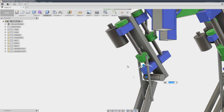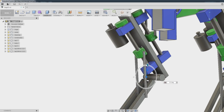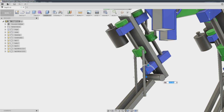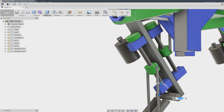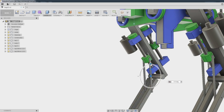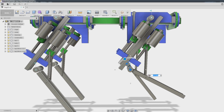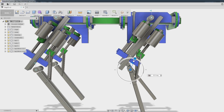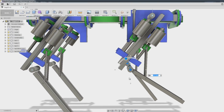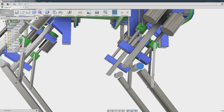And that's pretty easy to do because obviously we've got the motor turning, so we can put an encoder on the motor, we can put a home switch at one end of the ball screw to home it, and then we can work out at quite high resolution using an encoder how many times the motor's turned, or where it is in one revolution even, and that should give us quite accurate positioning over the length of the ball screw. Then using trigonometry, of course, we can work out the angle because it's a triangle, and we know what the sides are, and therefore we can work out what the angle is at the joint. That's why I've offset the joint here, because it makes it much easier if that's just one triangle between these pieces rather than having the joint offset at the bottom of this.